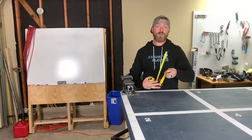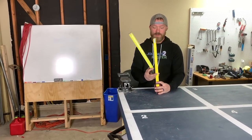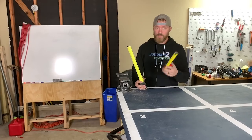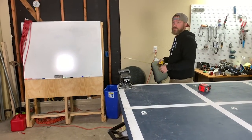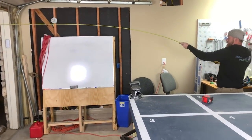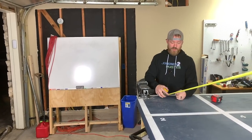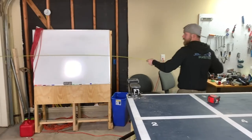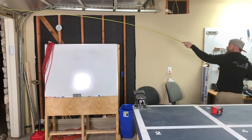What I like about the Fat Max is that the tape itself is wider — that's why they call it the Fat Max. Looking at the two side by side, the Stud's tape is definitely skinnier, though it feels thicker and more rigid, which is probably why it still reaches nine feet. The Fat Max breaks at around 11 feet — sometimes 13 to 14 feet on a good one — though at 14 feet the end starts to bow down and it's very hard to take an accurate measurement.